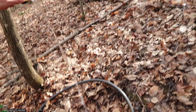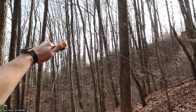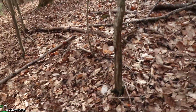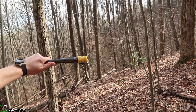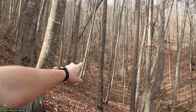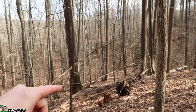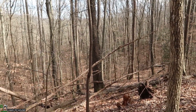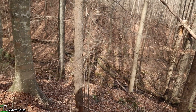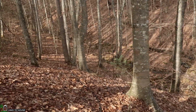Here is where the water is right now — you can see it's still pretty good. If I pick this up to find level, it's still coming out there. So what I'd probably do is put my barrel about right here and let the water flow into the top of it. I think this gets us 200 feet away from where we were going to have our original intake barrel. So I would basically have my barrel right here, and then it would just immediately shoot down there and head on to the house. We are probably somewhere around 30 to 35 feet easy above the source. So I like it.